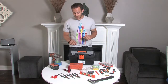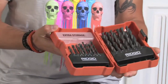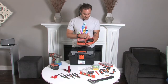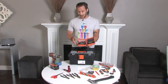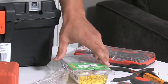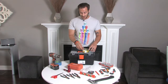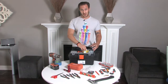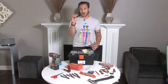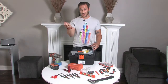With your drill, you're going to want to make sure you have drill bits. Go and get your all-in-one kit, which will have all your sizes that you'll probably need for any little project around your house — this goes up to half inch and all the way down to one sixteenth. Also make sure you always have a good set of plugs on hand. You're going to use these predominantly to hang pictures, posters, frames, mirrors, and all the heavy stuff. Drill your hole, make sure the plug fits nice and tight, then your screw goes in and you can hang whatever you want.